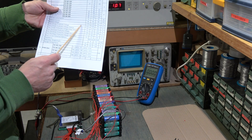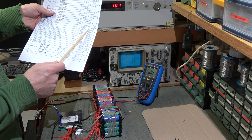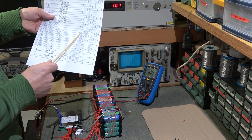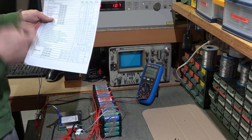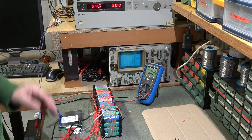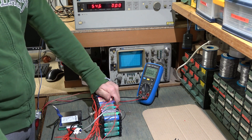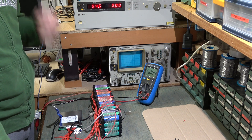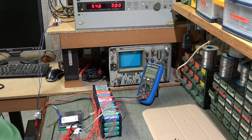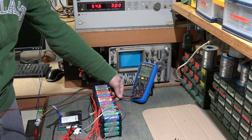The balance voltage range is 4.16V to 4.18V. The maximum charge protection voltage is 4.21V to 4.25V maximum. I previously fed the cells directly with my charger without the BMS, so some cells already exceeded 4.3V — the first cells — because I had no BMS at the time. Some cells reached 4.3V while others were still at 4.0V. They are unbalanced, and this BMS should now balance them.